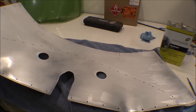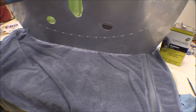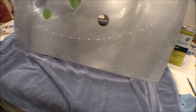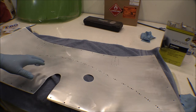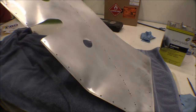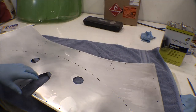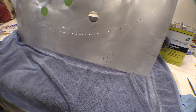I've got a bucket of alumiprep mixed up, diluted in a five-gallon pail for cleaning these parts. I took this out and scrubbed it with a clean Scotch-Brite pad and the alumiprep, then took it down and rinsed it off with hot water in the shower, and came back and scrubbed it again. Notice that it's not shiny anymore — and that's really a good thing. It gives more tooth for the paint to adhere to, but it's also a sign it's perfectly clean. One way you tell it's clean is if the water sheets off when you rinse it, and it did. There's no more oily film. So I'm going to hang this up by the stove and let it dry while I mix up the primer.